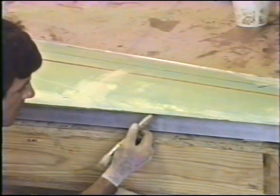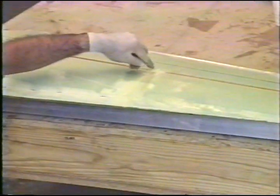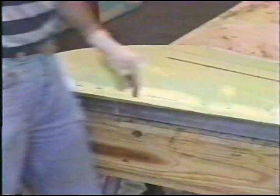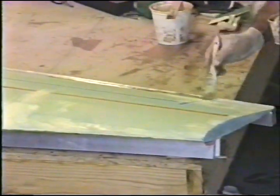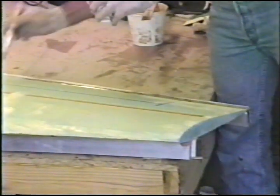We've filled that leading edge area that I mentioned so that there are no voids left. We've filled over top of the coaxial, burying it, leaving nothing too high. Coaxial comes out the other end. We've got about 12 feet of coaxial hanging out of here. And we're going to wet that leading edge, and we're going to also wet the trailing edge, the glass-to-glass area at the back end of the canard that finishes out the structural triangulation of this particular structure.